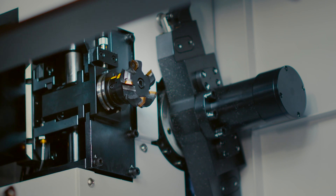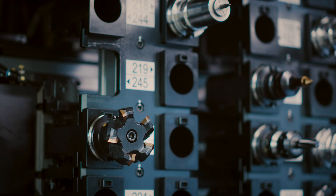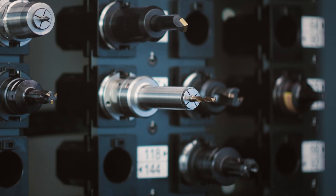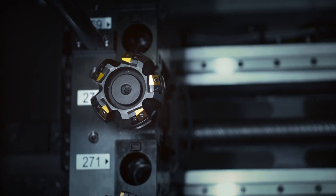So the first thing we have to know is: what exactly is a large tool? For this NHP 5000, the longest possible tool length is 550 millimeters or 21.6 inches. The largest diameter tool possible is 170 millimeters or 6.69 inches. The maximum weight that this beast can handle is a tool weighing 26.4 pounds. If you don't have an NHP 5000 and you want to know the maximum tool size and weights of your machine, check your Doosan instructional manual for those details.